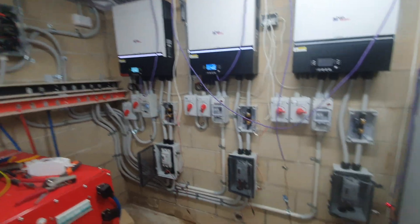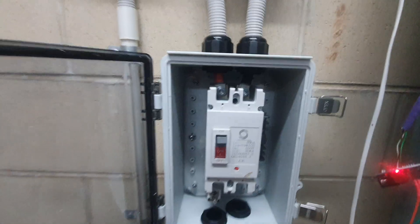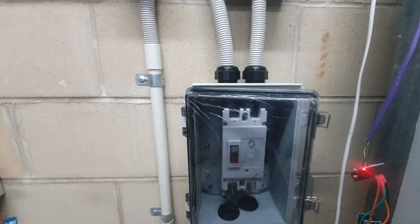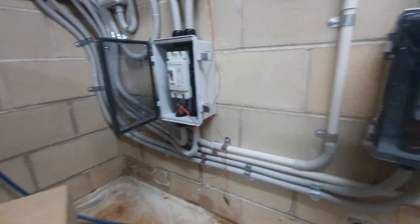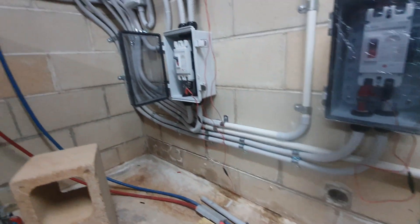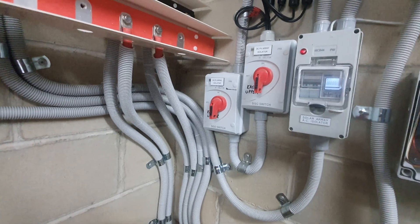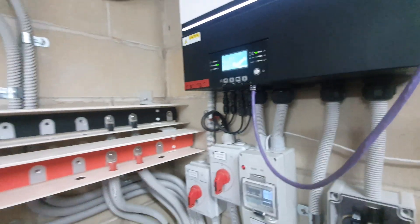You can see each one has got a DC breaker. There's a little trip that I've got to set up for 24 volts so we can actually have an emergency disconnection from the battery if need be. It's all in 25mm conduit, so I've got another two bits of conduit to come out of that one and go underneath, and eventually up into the bus bars. It looks a bit of a rabbit warren with the amount of 25mm conduit, but it adds protection.